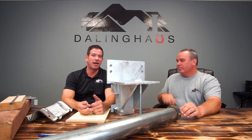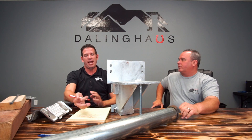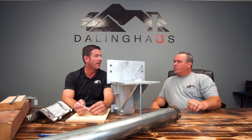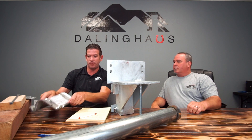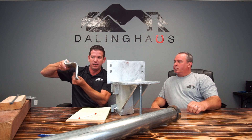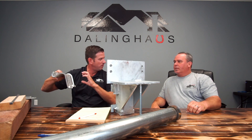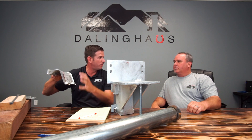Here's an interesting story: I went to a job here in Southern California where a homeowner was actually filing a lawsuit against another company. That company had installed the UFP-10 galvanized steel plate into brick. Brick is just individual entities held together by mortar, so in any earthquake it's just going to rip apart.